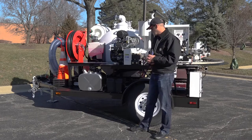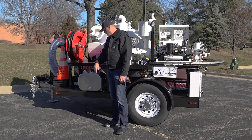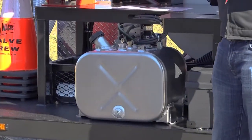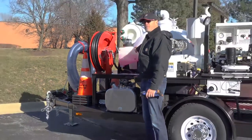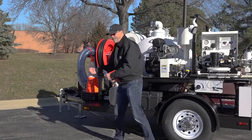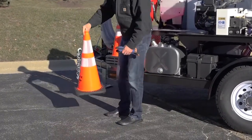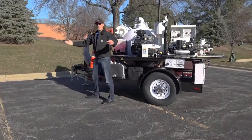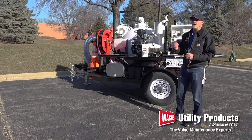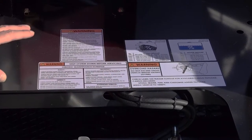We have a 12-volt battery used for starting your engine and running the electrical systems — lights, hydraulic valving — all run off the electrical system supplied by this 12-volt battery and recharged by the engine's alternator. Continuing forward, we have the fuel cell — the same style for gas or diesel. For the gasoline version you have a sight gauge to tell your fuel level; on the diesel, a sending unit ties into the control panel. Here's your charge tank for the pressure washer system, and this is the back side of your hydraulic hose reel — accessible from the curb side. You have four valve crew cones stored up here in the front.